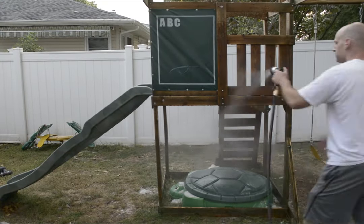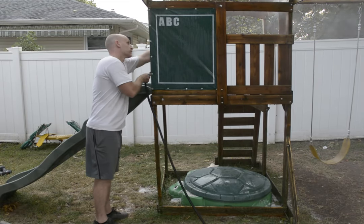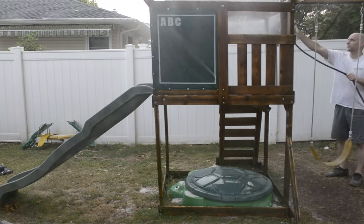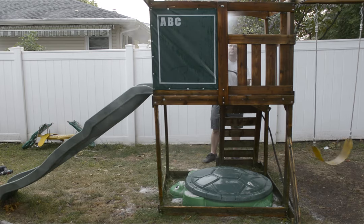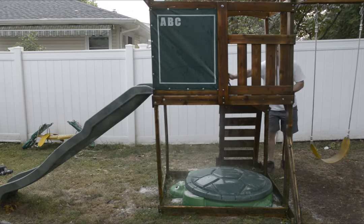Just give it a quick bath — a light washing to get rid of dirt, dust, and any loose debris right before staining. Now if you chose not to sand and wanted to pressure wash instead, this would be the time to do it. Or if you're using a brush and some dish soap, go ahead and do that now too — that'll work just as easily if the wood is in good shape.